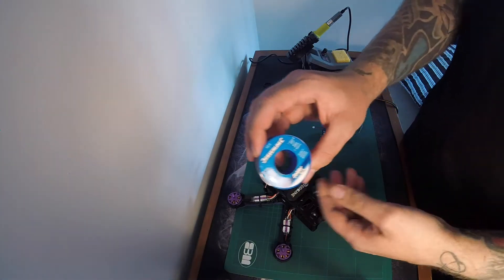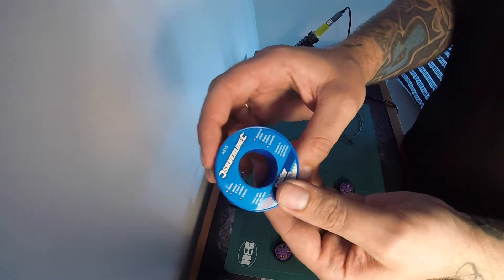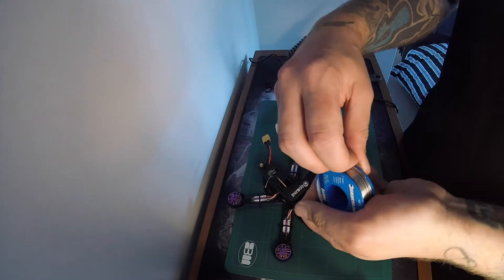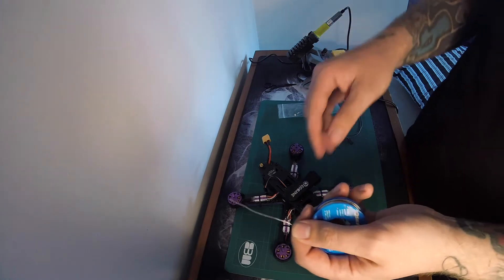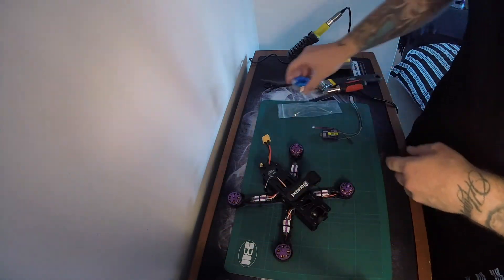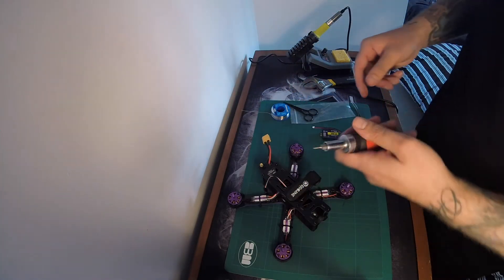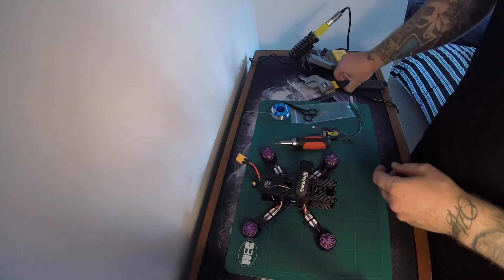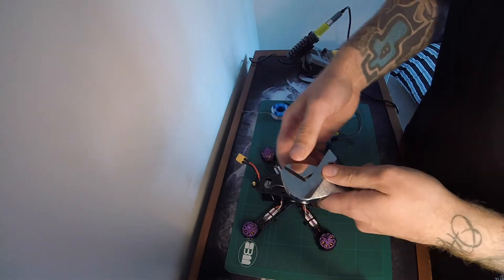What I've got today is some good solder — this silver line, I'll leave a link in the description. It's 60-40, so 60 tin and 40 lead — really good stuff. It works on a low wattage on your soldering iron, so it's a nice bit of solder. You're also going to need some scissors or snips, and a screwdriver with an Allen key fit to undo the top of the eShine. I'm also using a holder to prop my cables up while soldering, just to give me a second hand.